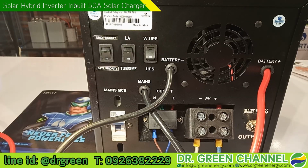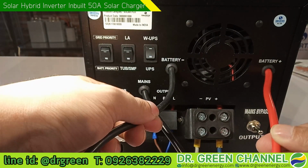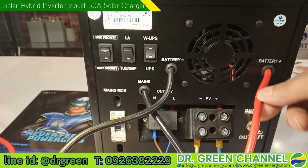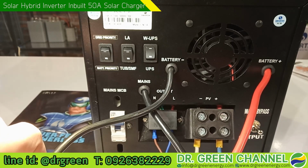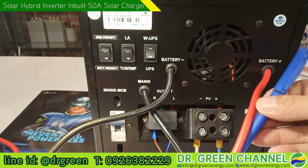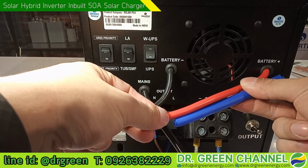Alright, we are at the back of this inverter, and let's look at the components one by one. The first one is the power cable to connect to the battery. This one is included, and the size is 12 square millimeters. It's big and also very safe to use with the 2 kVA, 24 volt system. You can see the comparison with the pen. The size is quite big.